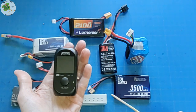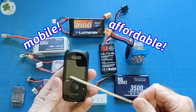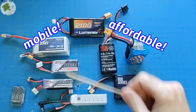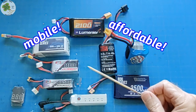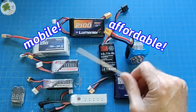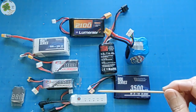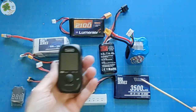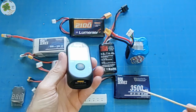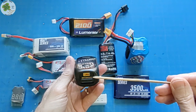First, besides being tiny and inexpensive, the M4 Pocket Charger charges a bunch of different battery types. It can charge regular LiPo batteries, high voltage or HV batteries, LiFe batteries, and although not advertised, I'll even show you a trick I use to charge lithium-ion batteries with the M4 Pocket Charger. The batteries you charge can either have an XT30 connector or an XT60 connector.